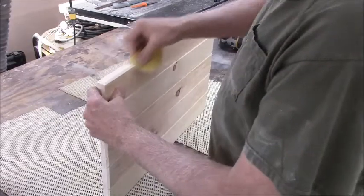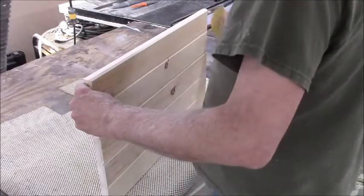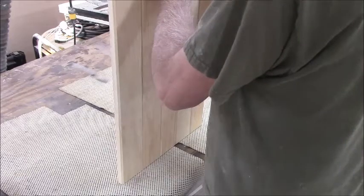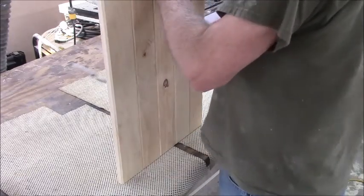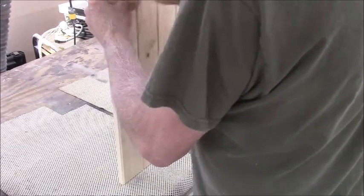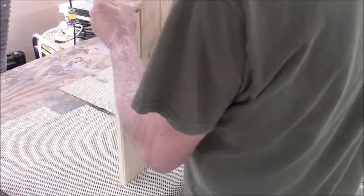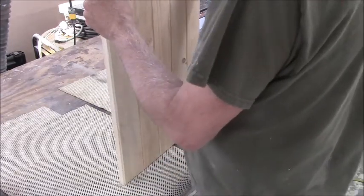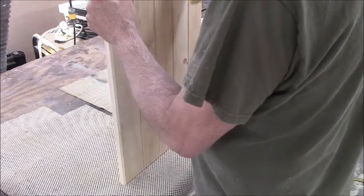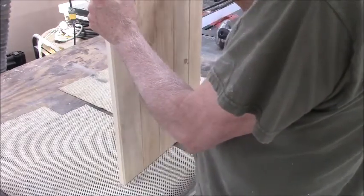Something they don't do on modern cabinets mostly. I've got cabinets that have been in my house probably 20 years now, and the bottom edges of the doors and the edges of the shelves have that super sharp edge on them — so you bump your knuckles and take some skin off on the stupid things. So we're just softening that sharp corner with the pad. The burrs are only on one side because the router bit was coming this way — when it cut into this edge it was shearing into the grain and cut it clean, but this edge here it was spinning off.